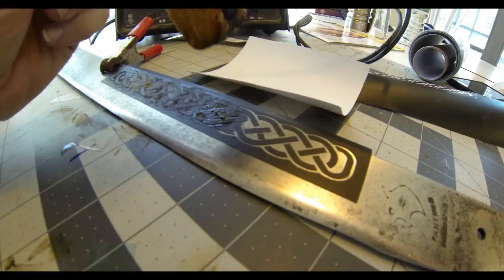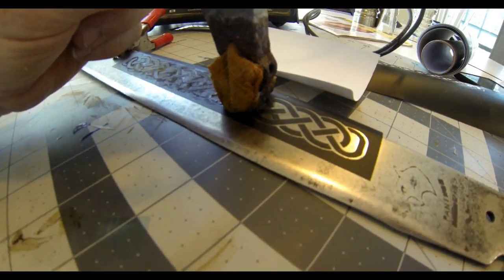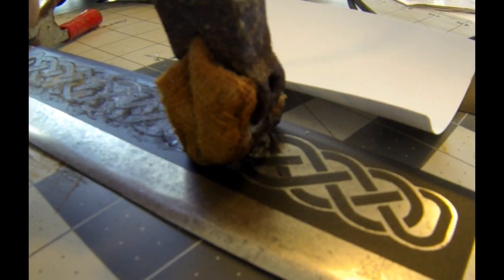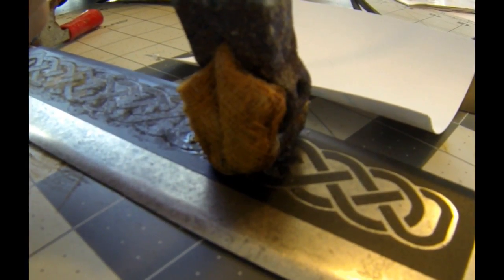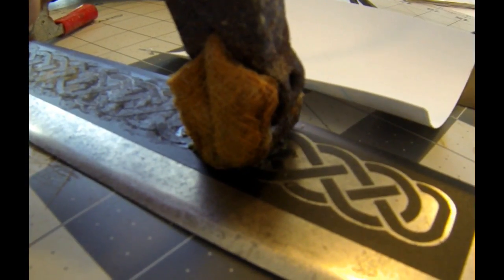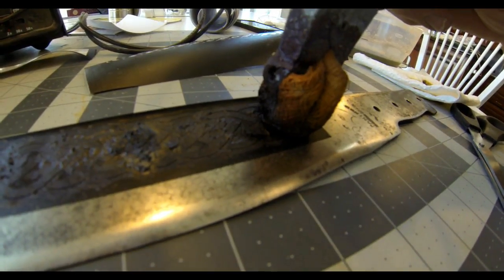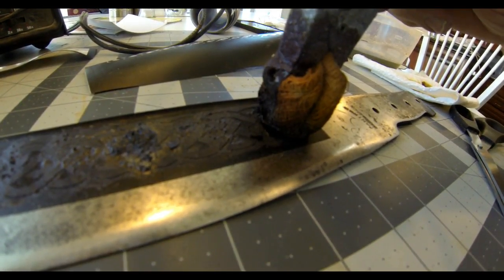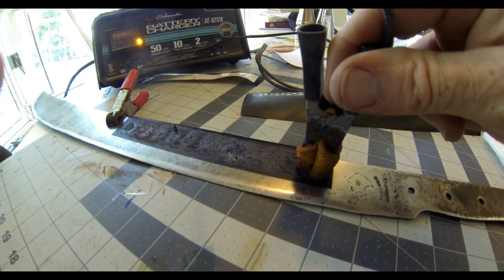The actual etching process is very easy. I'm using a 12-volt battery charger — I connect the positive to the blade, and the negative I wind up a little piece of four-by-four gauze, dip that into salt water, and wring it out as much as possible. Then you start the etching — one little segment at a time, 10 seconds at a time, then move down a little bit, overlapping. Depending on how deep I want the etching to be, I'll make additional passes over the entire template. For this project I didn't want the etching to be super deep — I almost wanted it to look like the etching had been on there a long time, with kind of the same patina as the knife blade. So I did a total of three passes.